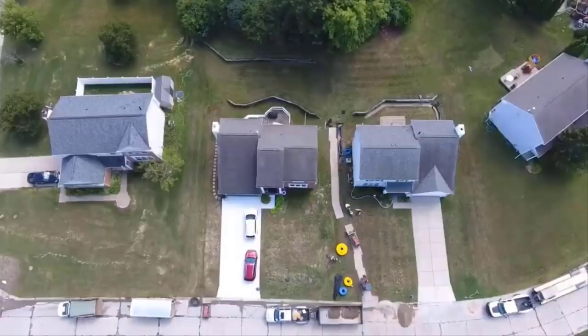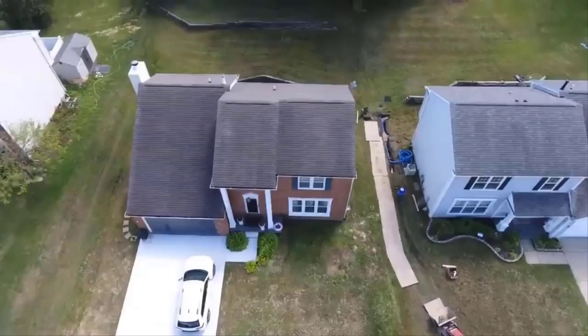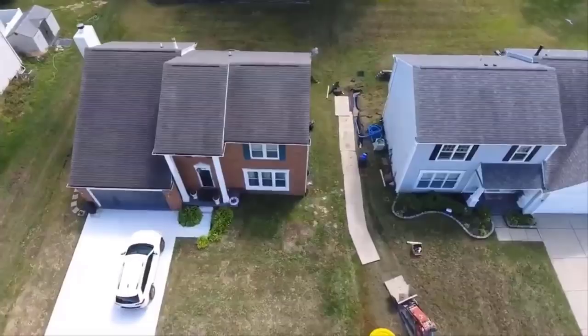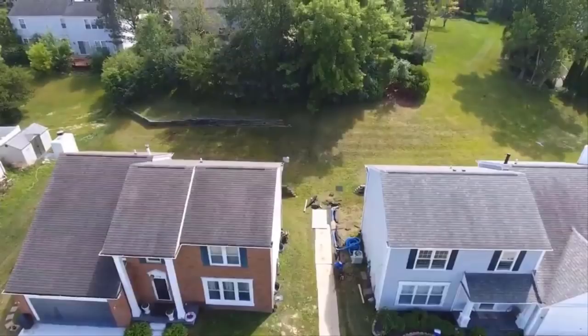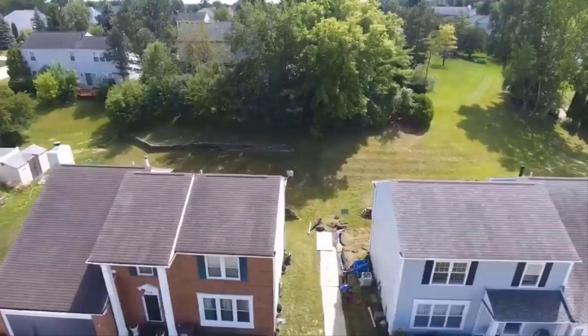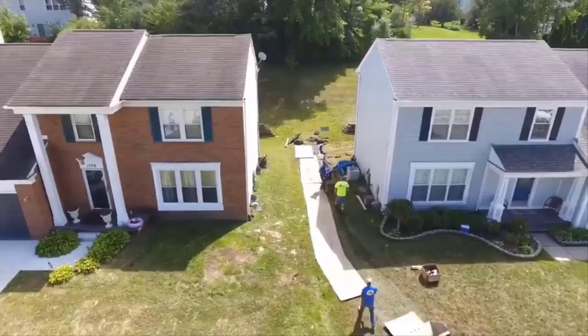So we're always going to put our collection system where the water runs. Remember, where does water end up? In the lowest point. So you want to put your system where the water's going to fall, where you're going to catch it, at the lowest point. It's going to go right through our open French drain in the back. And people are going to be a little bit confused on this discharge system. Sometimes we'll run a solid discharge line. If there's only 1% slope, you bet I am. I'm going to run just a solid discharge line. Now, we continued a French drain to leach field on the side of the house because we had 3% slope. Just want to point that out to you guys.